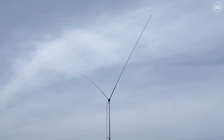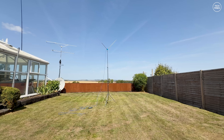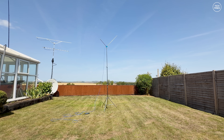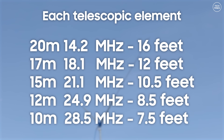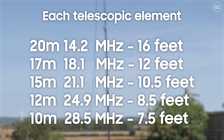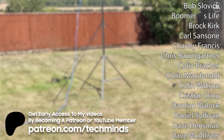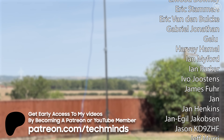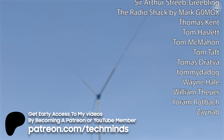I'll leave links to this antenna in the description below if you want to check it out. You can purchase it without the tripod if you already own one, or buy them separately — just watch out for the postage cost as the tripod is quite heavy. I did tune the antenna to most of the bands it supports from 40 to 10 meters off-camera, and I've included the element length measurements as a ballpark reference chart. One strange thing: the antenna is specced up to 430 MHz, but with both elements fully collapsed it came out around 144–145 MHz, so I'm not entirely sure how it reaches 430 MHz. Thanks so much for watching and I'll catch you in the next video.